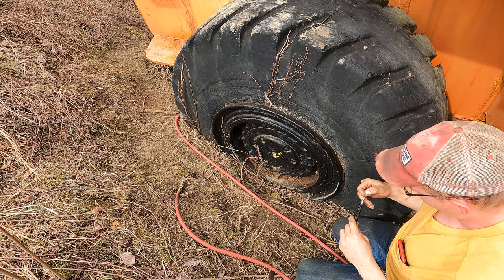It's still always going to be a little bit wet because of that pitting. The oil will stay in those pits as it comes in and out, but at least it won't destroy our seals more than they already are. Ideally, you would disassemble the cylinder and send the rod out to get re-chromed and then put it back together with new packing, but not in the budget for this machine, unfortunately. They both turned out about the same. I think this one has a slight bit more pitting than the other one, but should do the trick.